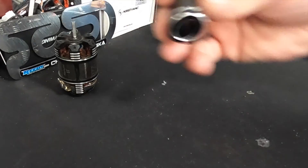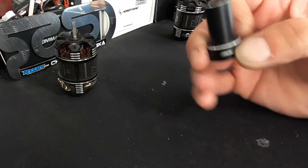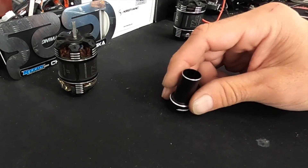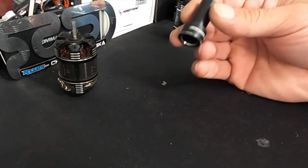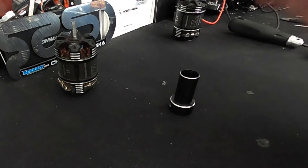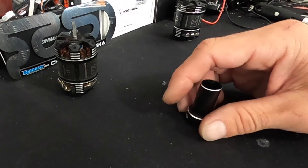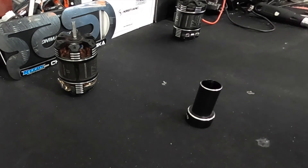There you go — that is some usage of the rotor replacement tool. It's new to my workbench, and this is one I leave in my toolbox all the time now. If you get to the track and get something in your motor, you've got to get in there and clean it — or you've just got time to kill. You can take a motor apart, clean it out, put it back together, service your bearings, stuff like that. These are great to have around; makes the process a whole lot easier than using a cardboard tube or something along those lines. Thanks for tuning in, everybody. If you have any questions, comments, or concerns, you can send us an email at northamerica@hobbywing.com. Thanks for watching.